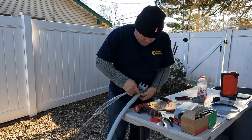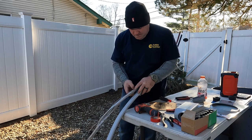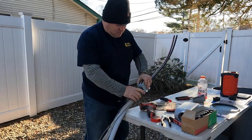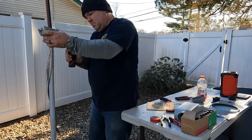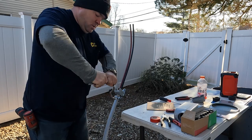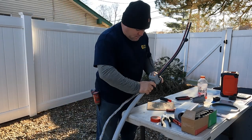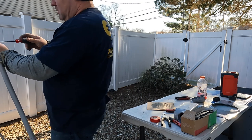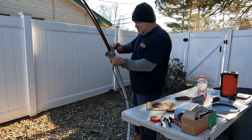You can do a nicer job on the ground too. What we do is we strip back the conductors, take off the sheathing, then attach the service head. I like to put the grounds underneath the clamp right here, then twist it together to make it a nice solid conductor before putting the service head cap back on. Then we'll walk up the ladder and fasten it to the side of the house.